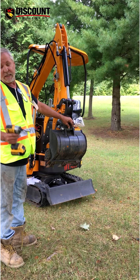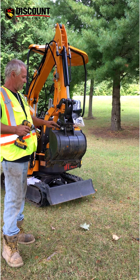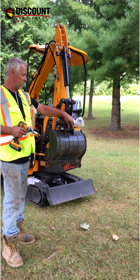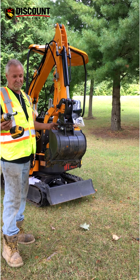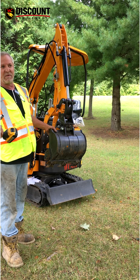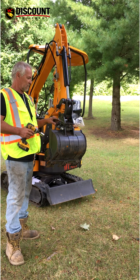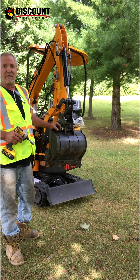So that's a quick connect and it's pretty simple. Now every bucket that you have will have these bolts attached to it, so all you've got to do is loosen this, pull the pin, loosen this bolt, and within a minute and a half you can change your buckets instead of it taking you 10 minutes. The quick connect attachment works a heck of a lot better — it's the way to go.